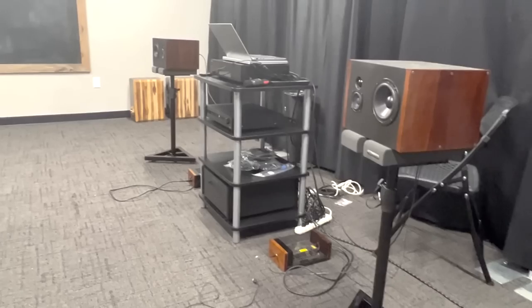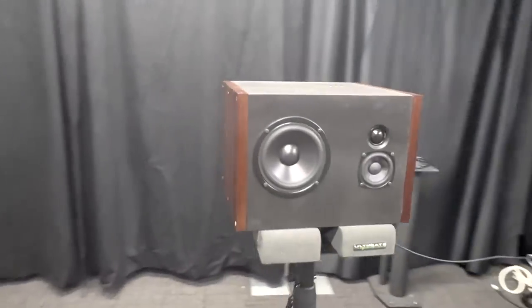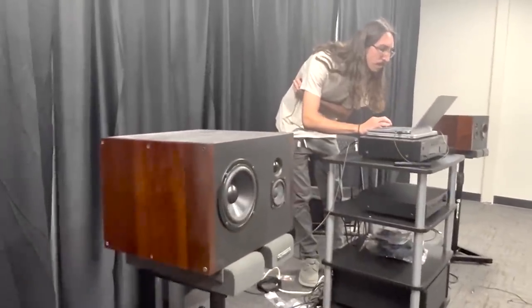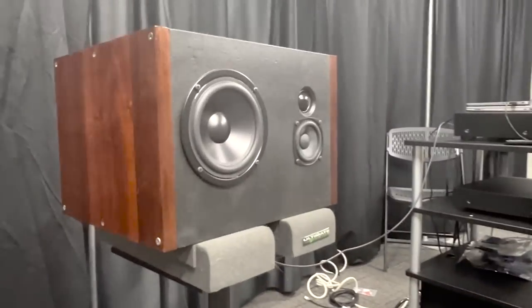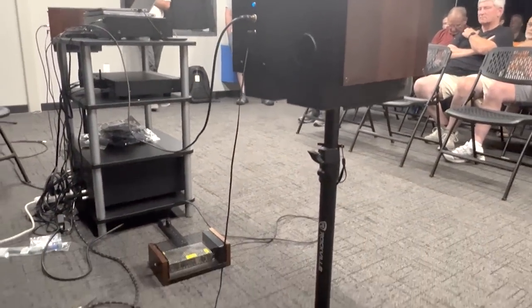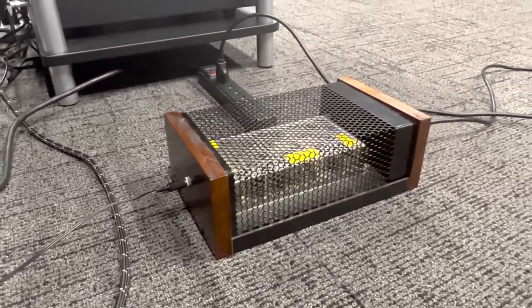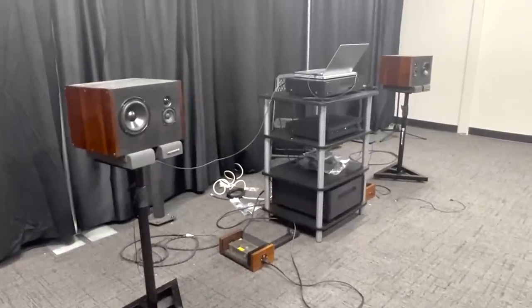Tonality is just as important, and I address that with these as well. The cabinets are a little older — I designed these in my senior year of college, building them in dad's garage. Everything about the design is inspired by having the best directivity possible, with a dome and no waveguide. It's a tri-amplified setup using all Dayton Audio KAB boards — the previous generation — with eighth-order filters on everything.